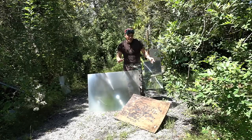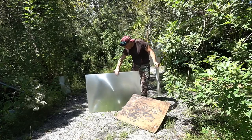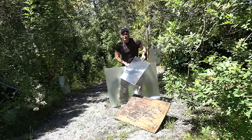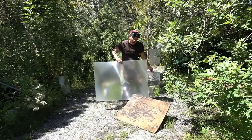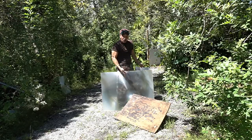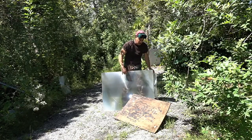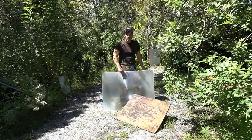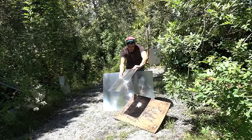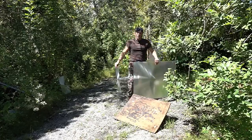The power of a lens is tricky to consider because clarity has a lot to do with it. If this were a crystal clear spot Fresnel lens, it would obviously have a lot more power than this dull one. But side by side, this larger lens has probably five to six times the area, so it collects five to six times the sunlight. It's putting it over a wider area. If you're cooking in a frying pan, a larger lens is going to help. I've seen people try to take small lenses or small page magnifiers that are eight by ten inches and try to cook on a pan that's ten inches in diameter — you're not adding any additional sunlight, you're just creating a shadow, robbing from one area to put it to another.